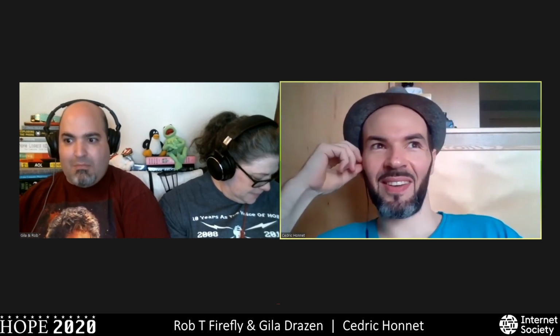One member of the audience asked about the washability of this material. I somehow replied on the Riot channel. I think the simplest answer is that when you make your own material, you have to wash it at the end because there's still a lot of chemicals, which are not too toxic at the end. But you still need to wash them, otherwise you get some kind of gray powder on your hands. And I usually wash them like 5 to 10 times, something like that, after functionalizing the material, and then it gets stable. So it's fairly reasonable after that. Obviously, if you wash it 1,000 times, super hot and so on, it will damage it over time, but it's reasonably stable otherwise.